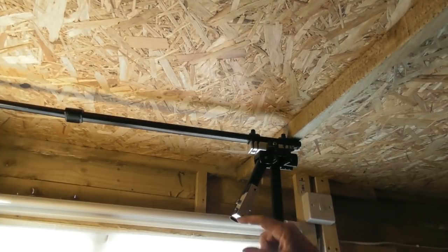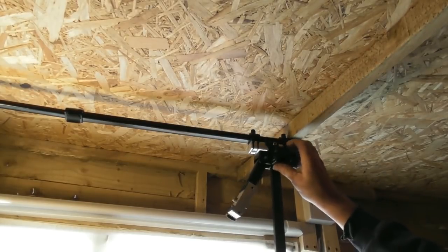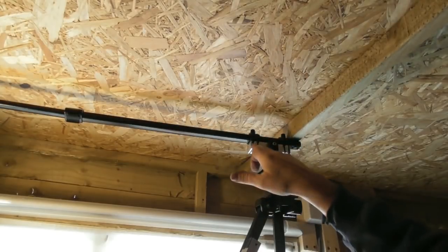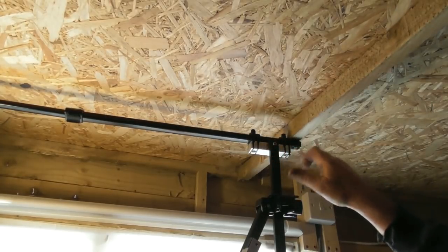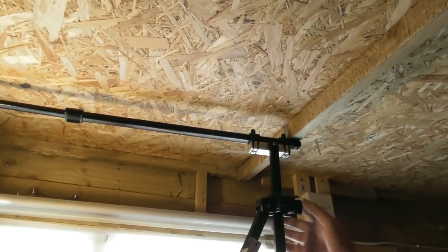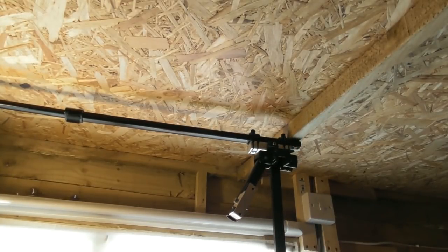Hacksawed 2 pieces of aluminium off, couple of drilled and tapped holes. This block is screwed through the back of this rod. The block in the top, let's just get that out the way, is screwed up into the plastic blocks with some self-tappers, and I've whacked some cable ties on there as well just because I can. I was worried about the weight, and if I knock it, it could easily rip those self-tapper plastic threads out, but that just gives it that extra security. So yeah, pleased with that. It cost me nothing, couple of screws, nuts, bolts, and 4 inches of inch by 3/4 aluminium.